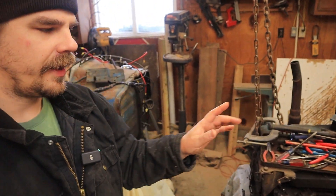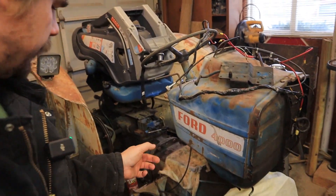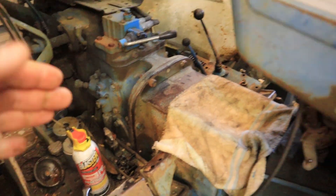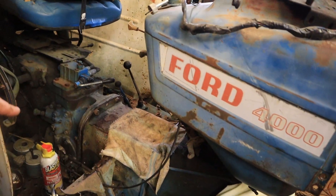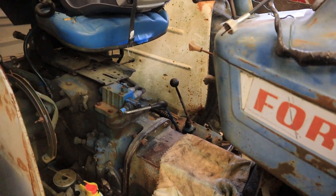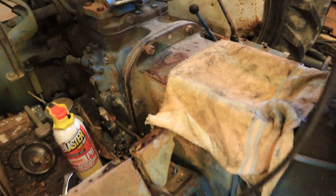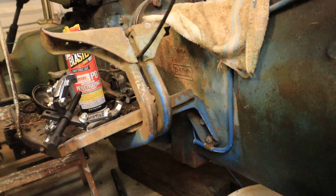Welcome back — it's a new day. I was able to borrow this engine hoist from my brother-in-law, so that should help out a lot. The goal for today is to split the tractor at the transmission. Being able to do that will bring this whole piece forward and allow us to push that lower shaft through so we can get that gear off. To do that, we're going to get to these eight to ten bolts holding it on, plus a few other miscellaneous bolts like the pedals. I did this job a couple of years ago for the PTO, so it shouldn't be too bad.